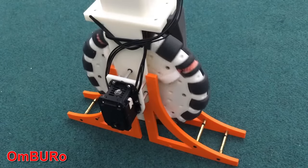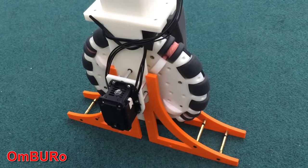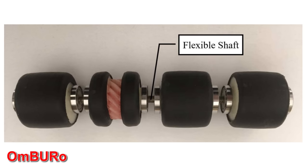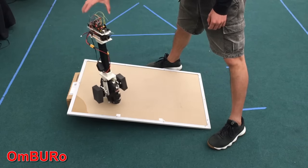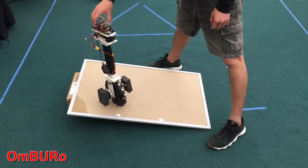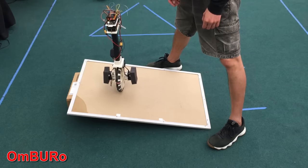There's a document which explains how this works in detail. The wheel has two motors in a differential drive configuration. When both motors rotate in the same direction the whole wheel rotates, but when only one motor rotates or they rotate in opposing directions, the smaller wheels around the circumference rotate. The document has a diagram of the gearing arrangement — the smaller wheels are driven by a central hub which is a 45-degree helical gear. This gear drives some intermediate helical gears which finally drive the smaller wheels; one in four of the smaller wheels is driven by the intermediate gear, and the other three are connected through a flexible shaft. I'm not totally convinced that this arrangement is efficient due to friction, but with a big enough motor to overcome it, it will work okay.